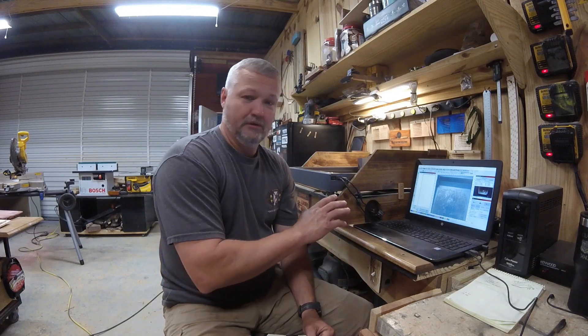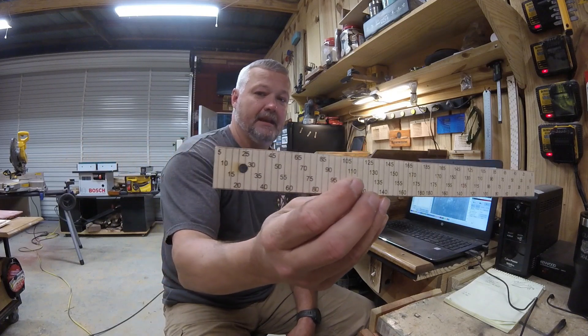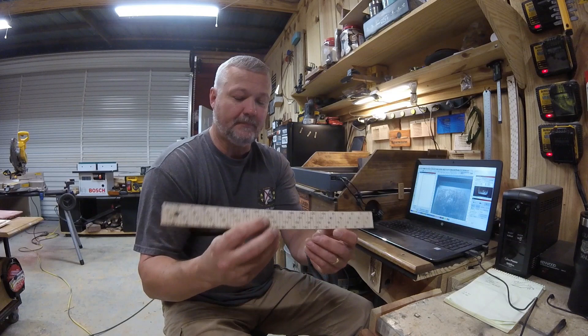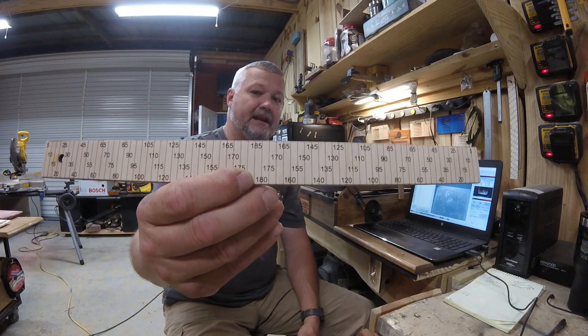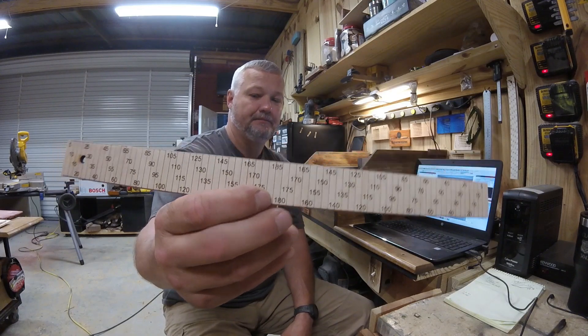After a short period I had an idea: what I needed was a custom ruler. Not your typical rulers — those are five to ten dollars a piece. What I developed is a laser-printed, user-creatable centering ruler set up specifically for centering your laser on your workpiece. It's a piece of quarter-inch Luan scrap. The center is at 185 millimeters, and going right and left it counts down in five-millimeter increments to zero. I also put a hole in it so it hangs on a nail at my workstation.